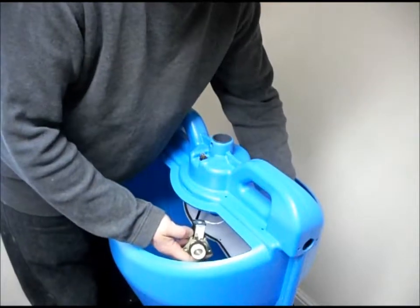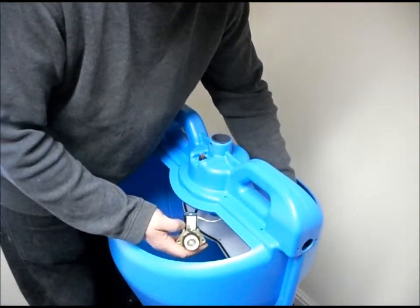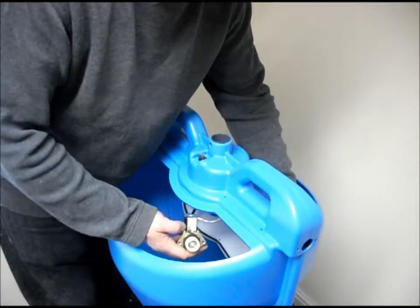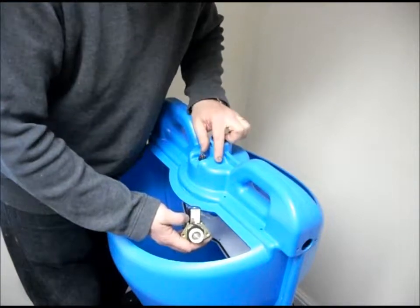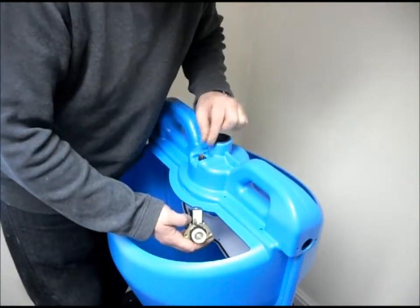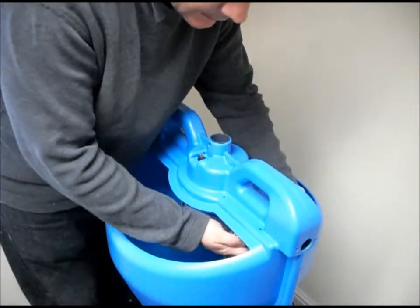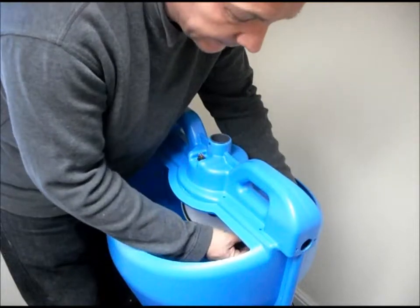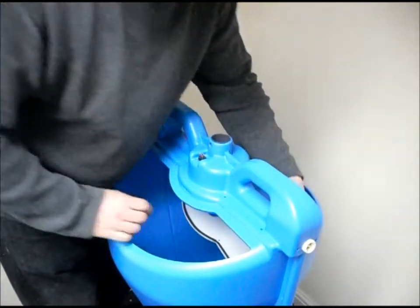and then putting it in to the hopper you have to be a little bit careful. There's a cable under here which links the sensor to this plug, and you don't want to dislodge that sensor because it's a very tricky fit to put it back on. Just gently move it to one side and poke the valve through and up into its position, like so.